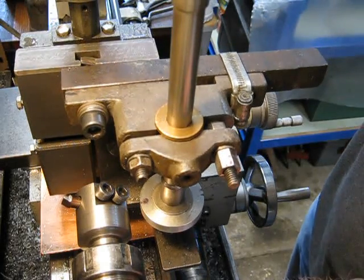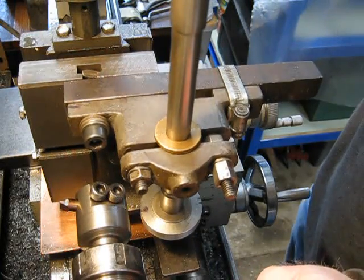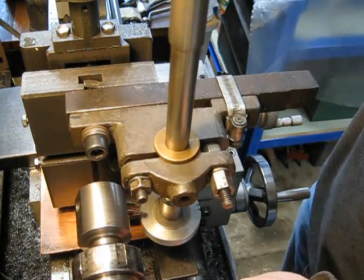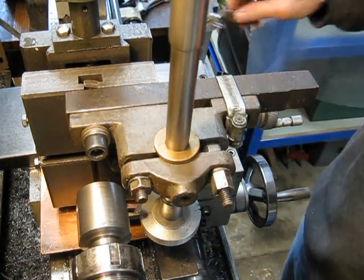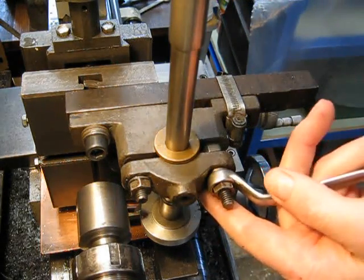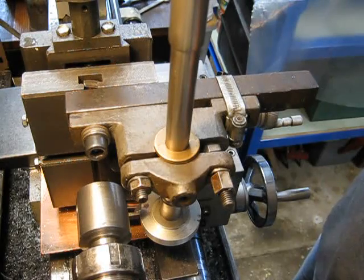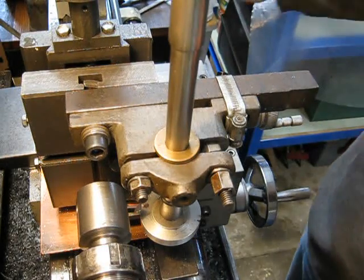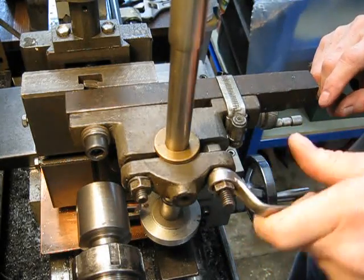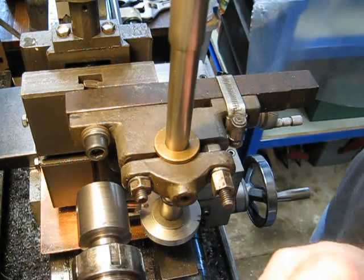So now, if you did it the other way, you would have to lower down — swing the cutter out of the way — lower down the blank until you get clearance. Okay, now we'll turn the shaft around and cut another position. It doesn't really matter, it's just a demonstration — I'm not actually cutting a gear as such here. All right, so now we'll bring it from the bottom up. Make sure you've got clearance.